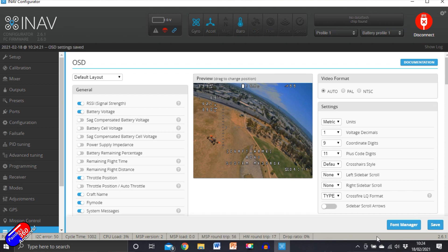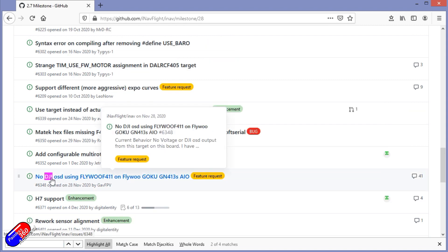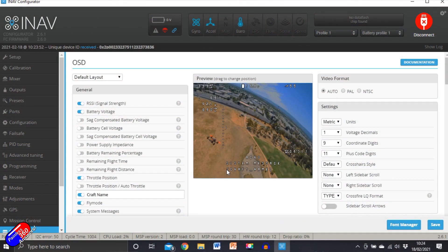Props to iNav for developing this and figuring out a workaround to a limitation that DJI haven't coded yet. I believe it was scheduled to be added to Betaflight but they haven't done it yet or they changed their minds. Hopefully iNav 2.7, which is due relatively soon, will have further enhancements to this. So Maurice, hopefully that answers your question — it's dead easy. By default it's turned on; all you have to do is enable the craft name in the OSD and drag it into the right position. Note that the position of elements in the OSD tab in the configurator dictates how they appear in the goggles, so it's worthwhile having your goggles connected and moving things around so they don't overlap with the default icons.